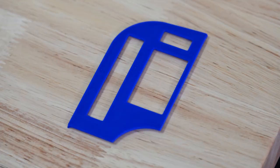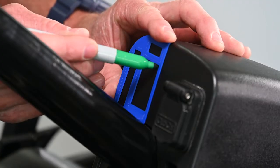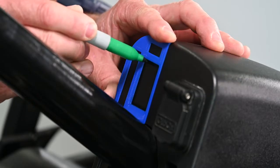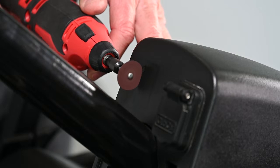The last cutout is for the operator switch. The ideal location for this switch is just above the steering column facing the driver. Included in the kit is a plastic template that will help you position where the hole should go and provide the proper size of opening required. Place the template on the plastic steering column enclosure in the location that best matches its profile. With a marker, outline the rectangle that gives you a hole size of 13/16 inch wide by 1 and 7/16 inches high. For best results, use an electric rotary tool to carefully cut out the hole.